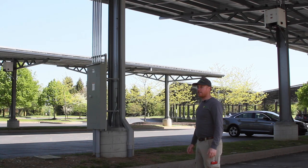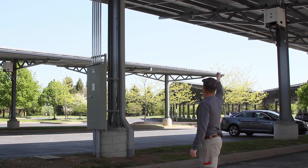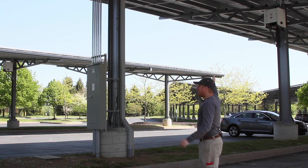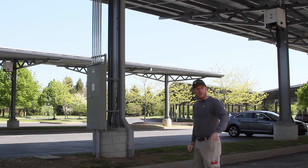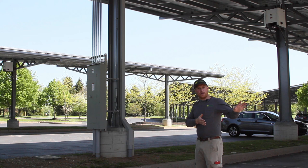Now let's take a look at some of the interior side here. Above me is the carport with the panels, and underneath that you can see all this conduit work — some of it for the LED lighting and some for the DC wires, which are coming down to this inverter here behind me up on the upright. That inverter changes the DC power into AC power. The AC power is then fed over and collected in these breaker panels — one breaker panel on each of the carports. The breaker panels then come down and go underground, and all of these underground runs will then come underneath the parking lot and hop up near the utility equipment out in front of the building. That's how all the power goes from the carports over to serve the loads of the building.